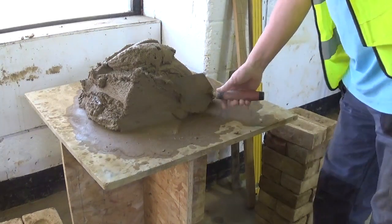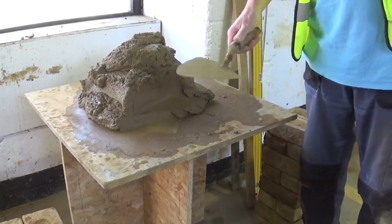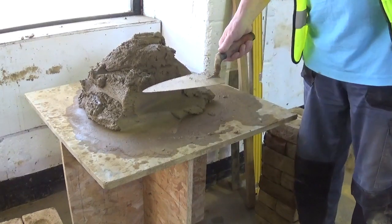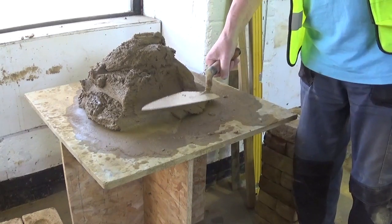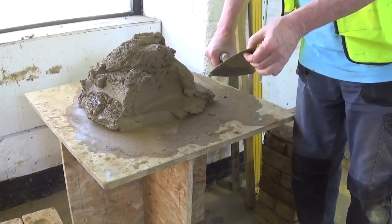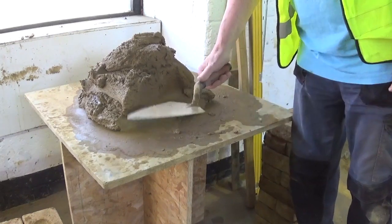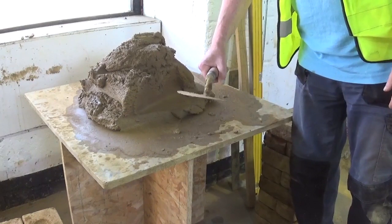This is how you roll the mortar. The first thing you need to do is hold the trowel correctly. You can see my thumb is facing the heel and then the toe. Sometimes you might let go and hold it differently — what happens is you tighten the knuckles up and lose that grip. It ends up straining on the ligaments. If you put your thumb there it prevents that, which makes it much easier to hold the trowel with weight on it. You're not straining as much.